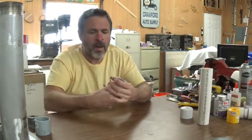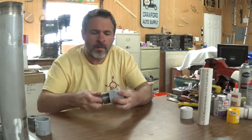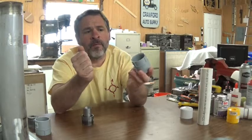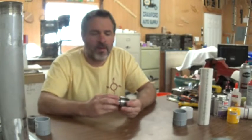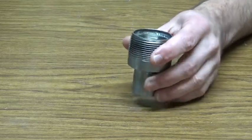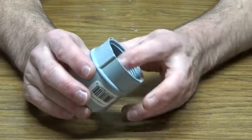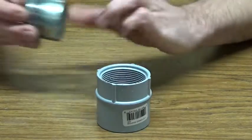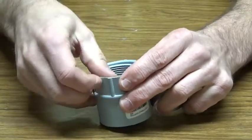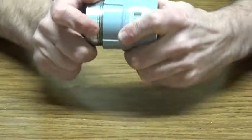That's the fuel cell, and then at the bottom we have a PVC coupling piece — a slip coupling that gets glued onto the fuel cell, with the other end being inch and a half female pipe threads. Those components are all the same as what we've been using for the other two models in part one of this video series. The difference today is this nozzle. Let's compare the old test nozzles to our finished nozzle. The motor bottom has a PVC coupling with inch and a half PVC threads, and previously we used a threaded piece of steel with a washer with a number 26 opening in the center, which simply tightens up against that to hold it in place.